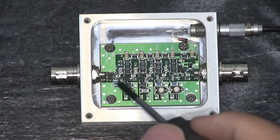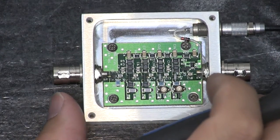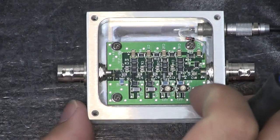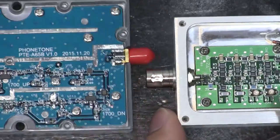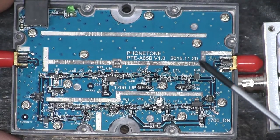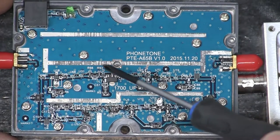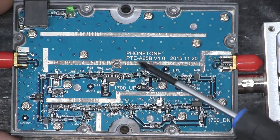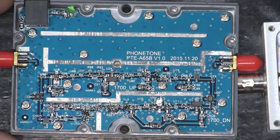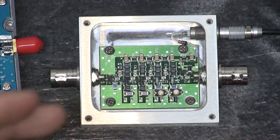It's amazing how simple one of these little tiny devices are — these block elements where you feed a signal in and get the result perfectly every time. This preamp is probably in the kilohertz to maybe a megahertz range. Then you start getting into microstrip line design where you have to have controlled impedance between the trace and the ground plane. As you get to higher and higher signal frequencies, you have to change the substrate so its dielectric constant is less lossy for your signal traveling through the microstrip line. At even higher frequencies or lower intensity signals, you'll start to completely shield them by burying the trace between ground planes on either side in a multi-layer board. RF is black magic, and these little block amplifiers are nice components when you just want to feed a signal in and get your result reliably.